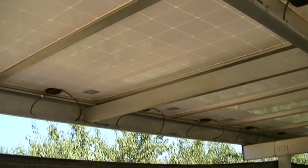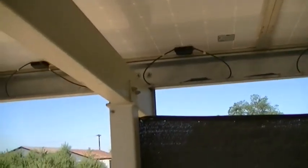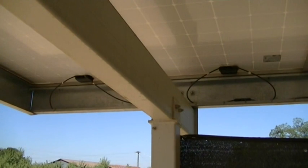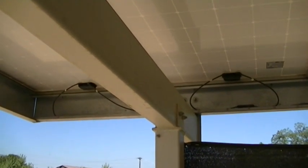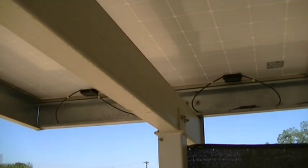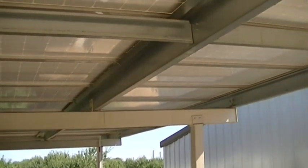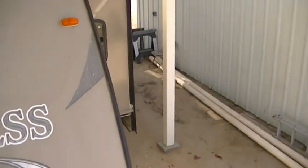Let me show you the posts. I have 5x5 posts with a welded three-eighth-inch plate on top and quarter-inch arms that come up, bolting through with half-inch bolts through the cradle plate and the 4x10 beam. That's how we make the connections — it works out really clean and nice, all engineered and done very well.